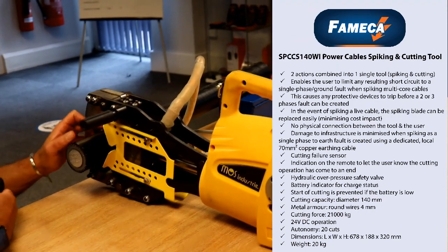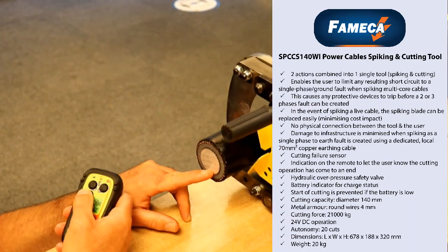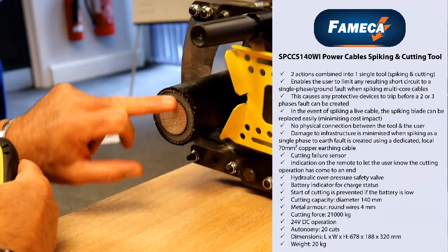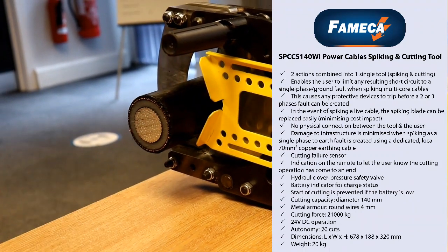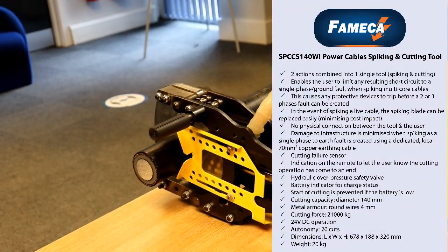So you can demonstrate the fact that the spike's just about going in. Obviously this is a single conductor cable. If you've got a tripolar with three conductors in — so you'll have a conductor there, there and there — it'll just nick. You wouldn't necessarily know that though. It's been designed that way; it'll only nick one of the conductors.